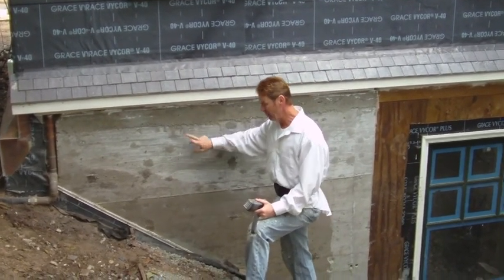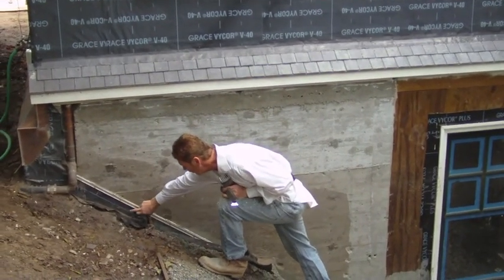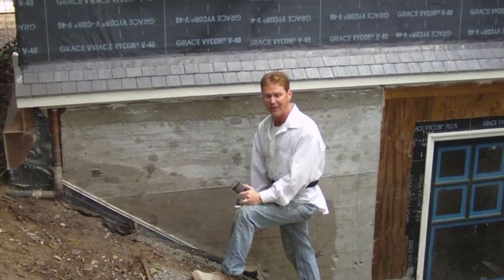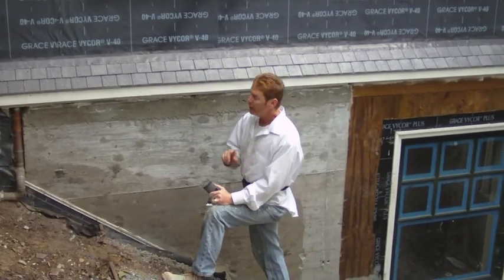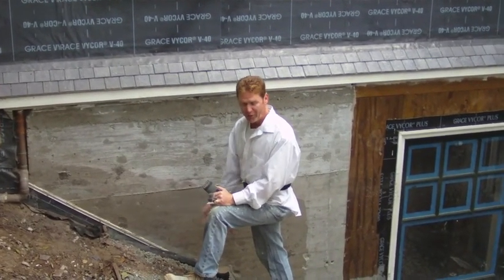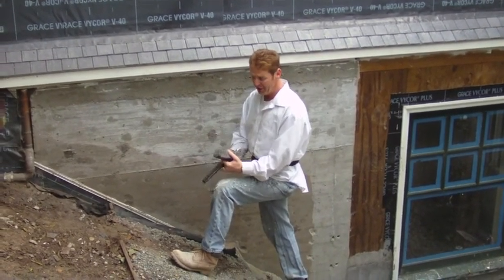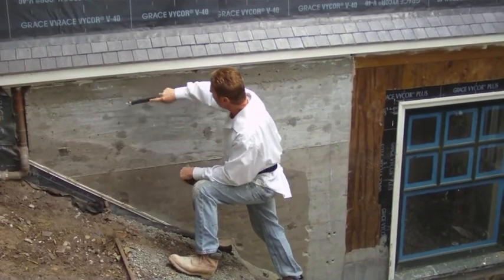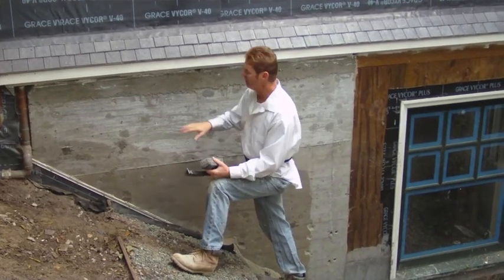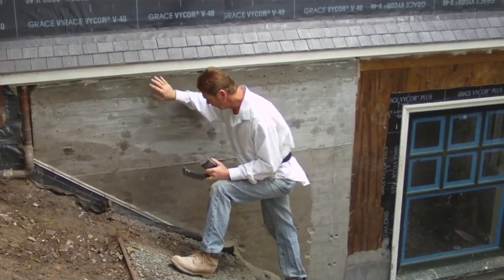After we place our grace membrane on this concrete, we're going to cover it. We want to watertight this foundation, although it's a foot thick and chances of it leaking are pretty slim — we're still going to do it. Since we've already had eight months of rain this year, I decided we're going to wire brush it instead. I'll wire brush all this dust off, then use the grace membrane product — it comes with its own adhesive. We'll apply that adhesive to this cement, then apply the grace membrane.